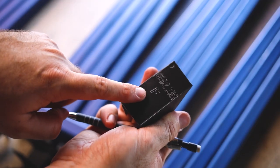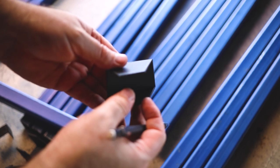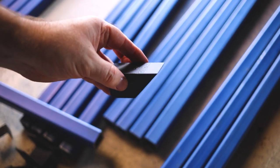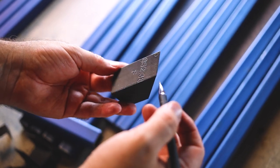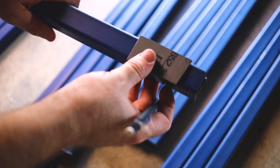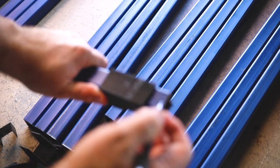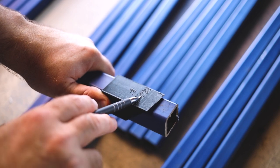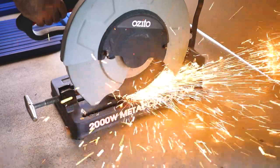I created these 3D-printed little measuring jigs that have the angles I need to cut the steel at. I've done it this way to get precision with my angles instead of having to manually figure them out. They just slide over the bar so I can trace the cut lines. I've also got the measurements and the letter labels on these corresponding to the plans, so if you're interested in doing the same thing, hopefully this will help. I've now finished the square bar cutting and grinding, so these should be ready to go.